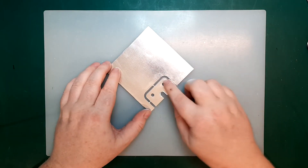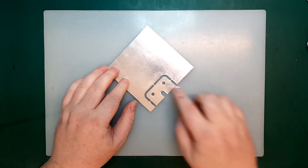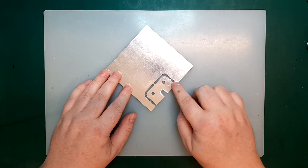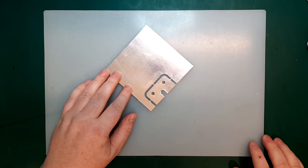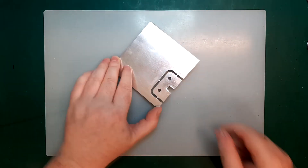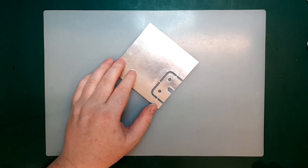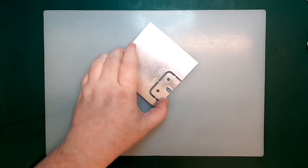Here we have the result — I think it came out quite nice. Total machining time was about 10 minutes, so not too bad; definitely quicker than making it by hand. The great thing about CNC is that it always comes out very accurate, and if you need to make small changes it's easy — just update your CAD file and make a new one. We can see the small tabs here; they held very well and kept it in place. I always use tabs with aluminium especially, because otherwise it risks going flying and could damage your end mill. A few tabs is much better and they're quite easy to get rid of.